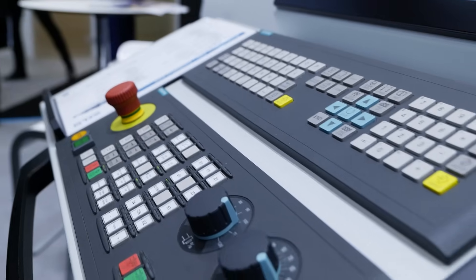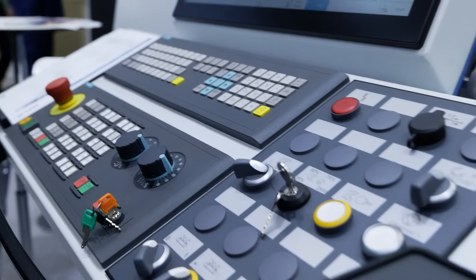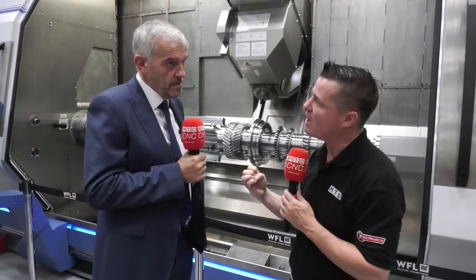I've been around the world, Steve, and I don't always see that. What you've just covered is a wonderful thing, and these days a lot of people focus on cost per part. If you look at cost per part on this machine, a lot of our machines in the market are plus 20, plus 25 years old and still delivering the same levels of accuracy and performance. Even when we see machines out there cutting exotic and harder materials, we start looking at feed rate, depth of cut — how rigid is it really? How much time are we losing on those cycles when we think about how quickly we can push through, based on that strength and rigidity and the power required to cut those materials?